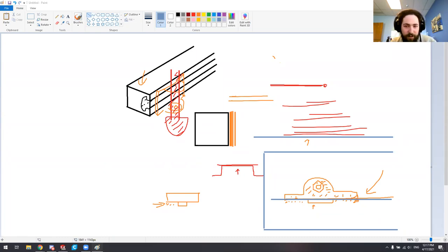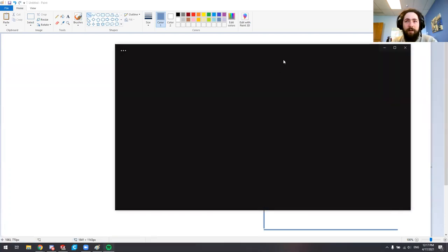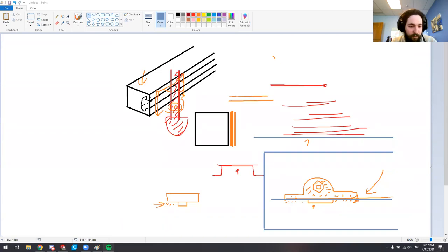We covered in-plane versus out-of-plane strength and covered overhangs and bridges. We can split parts into multiple parts — we don't have to keep everything as one. One of the things about rapid prototyping is we can make multiple different prototypes and find out what works. We don't have to design the part right the first time, so don't feel too pressured. Feel free to experiment.